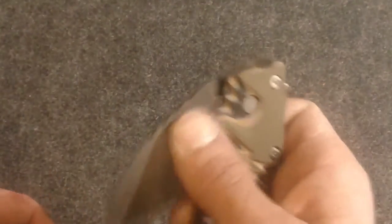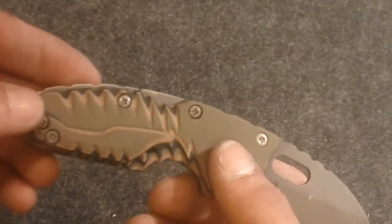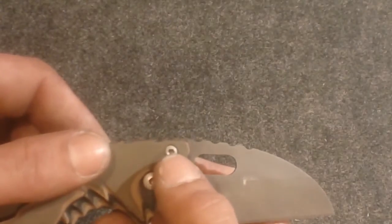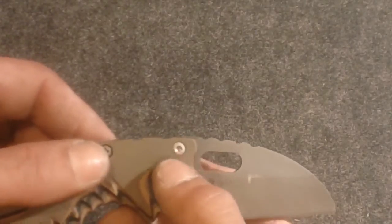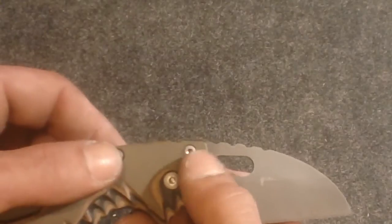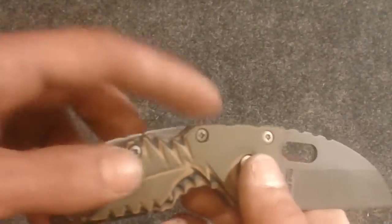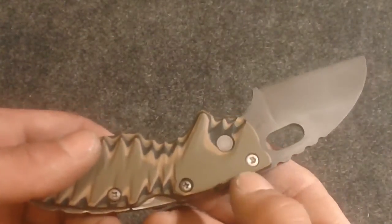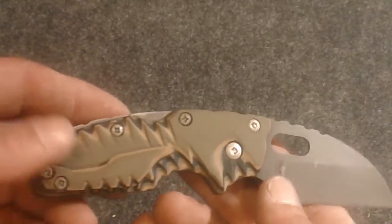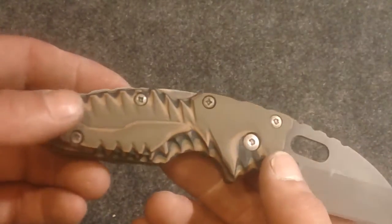So let's take a look at her. I did acid treatment on the blade and went ahead and acid-dipped the screws. These two screws — like the pivot on this side and the standoff up here — had to be a different size so I could get this lock to work. The coating on these screws is a lot more resistant to the ferric acid than these screws are. But the backside of the pivot did well, and I think if I'd left it in longer it would have turned more. I just didn't want to leave it in overnight — it was just too long.